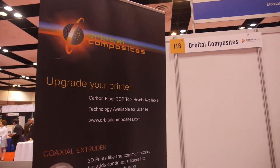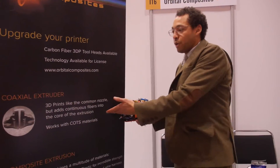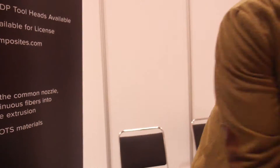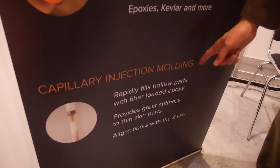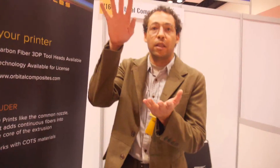So your company is upgrading 3D printing — these are some of the novel technologies we've generated. The coaxial extruder enables us to print continuous fibers, allowing 3D printers to create end-use parts. The next technology is capillary injection molding — if we add short-chop fibers into our injection epoxies, we can get fibers aligned with the z-axis across the print layers, dramatically increasing print quality and end strength. You can also build much quicker by printing a thin shell and injection molding it in place to create a solid object very quickly.